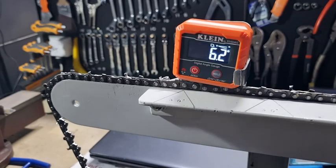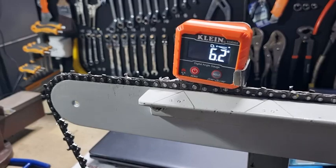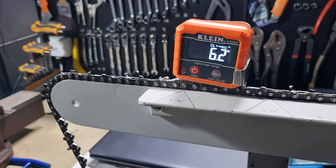Now, on a brand new chain using the Stihl progressive depth gauge — we would put the Stihl progressive depth gauge on the new chain and just run the file over on the hard setting. In most cases it barely took anything off, maybe a whisker. We had an attack angle of 5 on the hard setting and an attack angle of 5.5 on the soft setting. The Husqvarna was way below that — on the hard setting it gave us an attack angle of 3.2, and on the soft setting it gave us an attack angle of 3.5. Very, very low, but nonetheless it still cuts quite well.